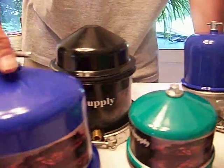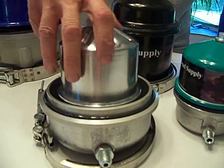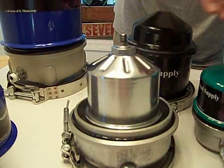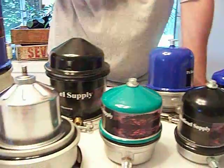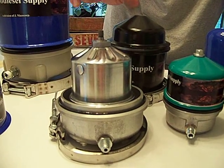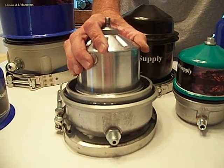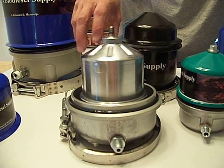This is our 108 model. It comes with a band on it — nickel plated, or one of the other coatings on these to prevent rust on your rotors. This one is dynamically balanced — they all are balanced. This one is 1.8 gallons per minute, requires a half horsepower pump, and is capable of holding 20 ounces of contaminants.